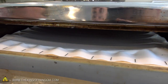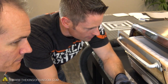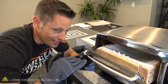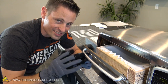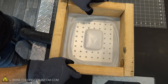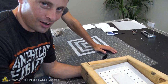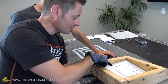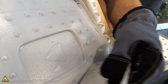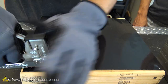How long has that been in there? Way longer than the styrene. I wonder if we should turn the temperature up a bit higher. What's the temperature at? Pizza temperature. Our HDPE has not gone clear yet, but it is sagging down about two inches. So I think we're just going to go ahead and throw it on the former and see how it does at this state before we push it any further. Initiate suckage. So HDPE obviously takes a lot longer to set up. It actually sucked the plastic right through the holes there, so we lost a bit of our suction. I thought for sure that foam would have melted. Look at that — it's all wrinkly on the inside. It's a little bit flimsier too.